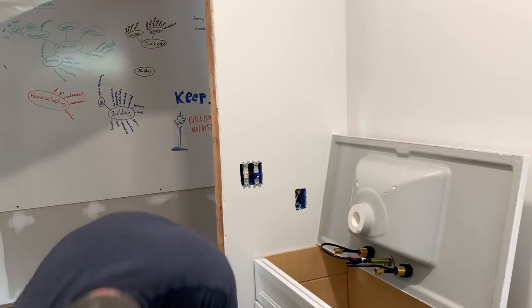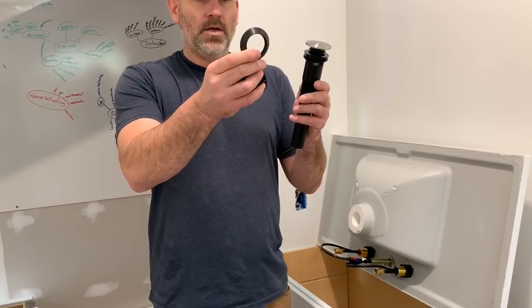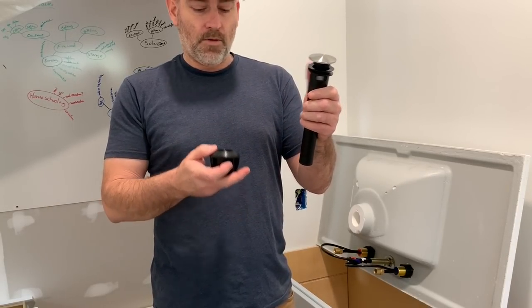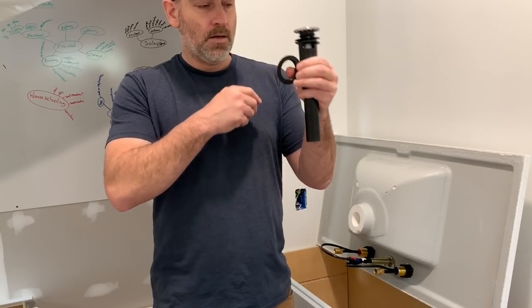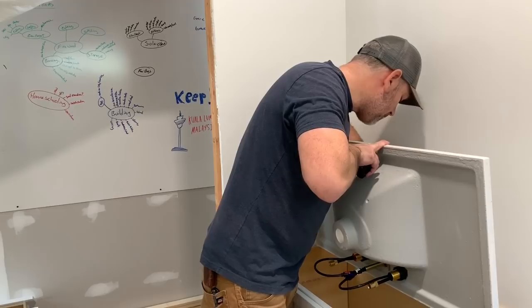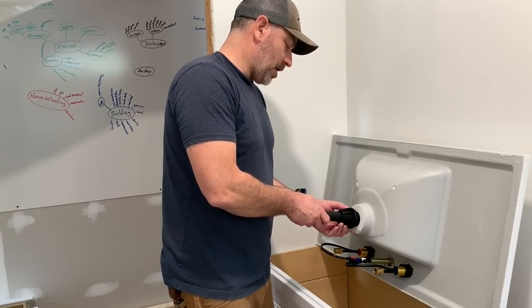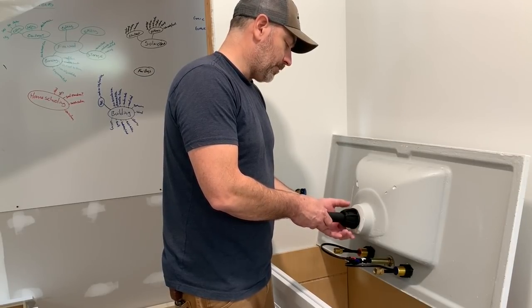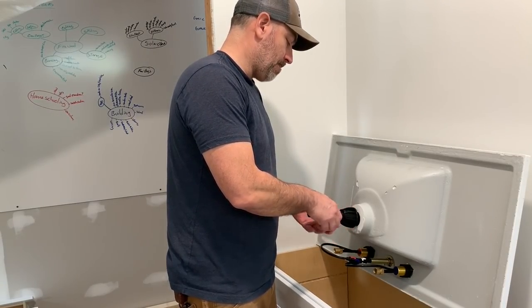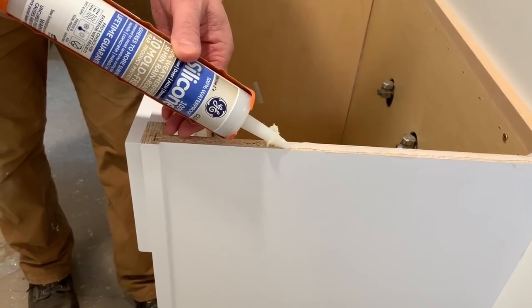It says to disassemble pop-ups. We got this flat gasket, this triangle gasket, and this nut. The flat rubbery gasket goes like this — you confirm — that's right. Then this one goes this way. After we partially thread it, then it says to connect to drain, and firmly hand tighten that. We use this on the windows and for the sink when we installed the kitchen sink.